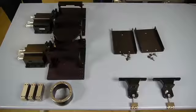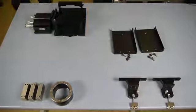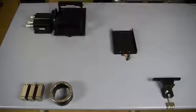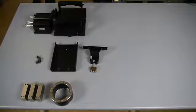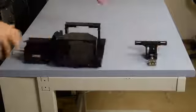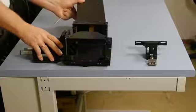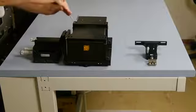All you need then is a little reconfiguration of the Sigma kit depending on the module and application you use. Let me demonstrate how easy this is. For simplicity, I just show you this on the west side positioner — for the east side, everything is identical. Let's start with setups in the 60 to 220 GHz range. There are several large form-factor mmWave modules available on the market. They are very easily mounted to the integration kit — just insert the mmWave module in the clamp and fix it with the screws.